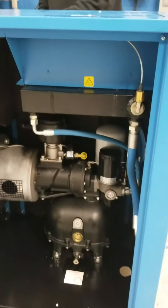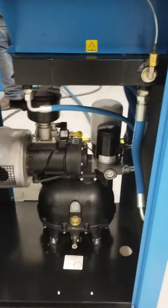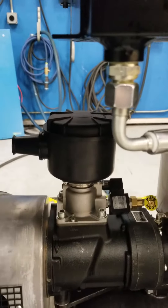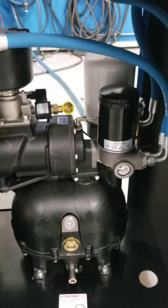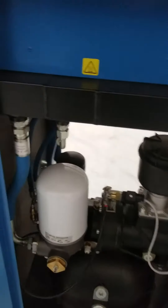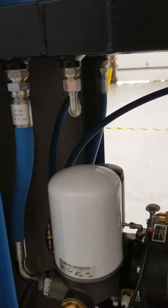Go ahead and take this panel off too. Here's our inside here. At the bottom there you can see the oil sump, and then it's all spin-on filtration. You've got a spin-on oil filter; the white filter in the back is the air-oil separator — that's spin-on also. And then your air filter just spins off and on the top. Extremely easy to service. You have your oil drain right down here. You can literally do the service on this unit in 15 minutes or less. It is a direct drive unit as you can see here. Very minimal hoses, which is an added plus — less leaks.